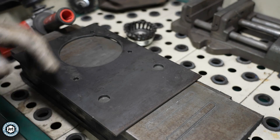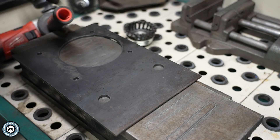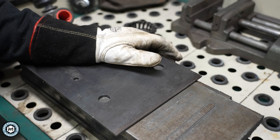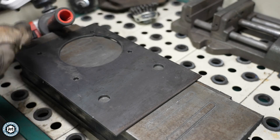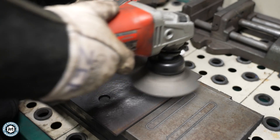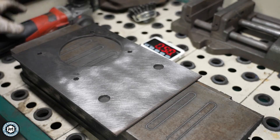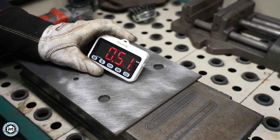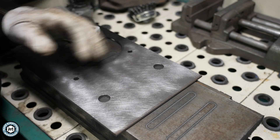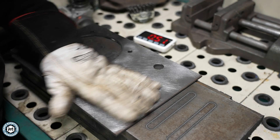Here's a pretty basic piece of quarter inch plate cut on the plasma table. I'm going to hit it with the diamond brush so you can see how quickly I can bust through the mill scale, get down to bare metal, and also leave a really cool effect if this was going to be a decorative piece. Almost immediately down past the mill scale and to bare metal — less than a minute to get this down to perfectly clean bare metal without removing any major material by grinding. Also a really cool swirl pattern that's very unique.